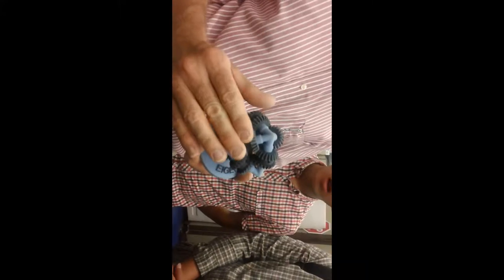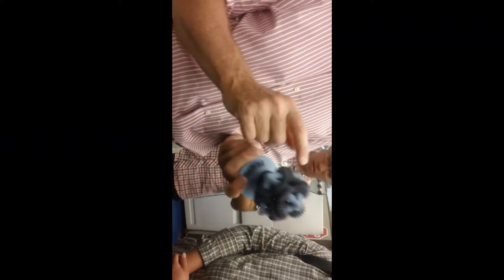There's something that's very unique about rapid prototyping. This was all printed. This was not assembled. We did not assemble it. We printed. You can see there is no place that it was ever assembled. The key to make it is you have to have an air gap. There has to be air between the parts. So then that air gets filled with the support.